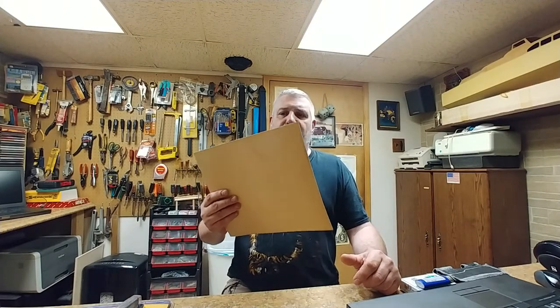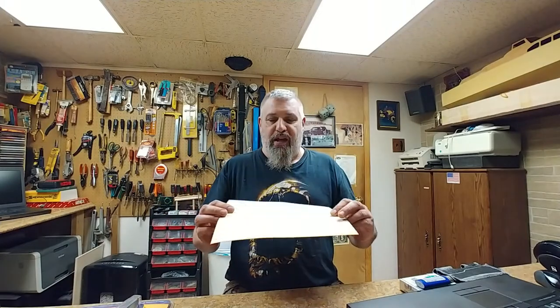I've seen a lot of different things used as shims — guitar picks, credit cards, wood shims, business cards. I don't like to use wood or anything paper-like such as a business card as a shim. To me that can be a little too spongy, and over time it could break down — you just don't know the outcome later on. Veneers are pretty good depending on the type; a harder wood veneer will last longer without compressing. This is a maple veneer but it has a paper backing, and I'm sure if I put it on a hard flat surface and took a hammer to it, it would compress.